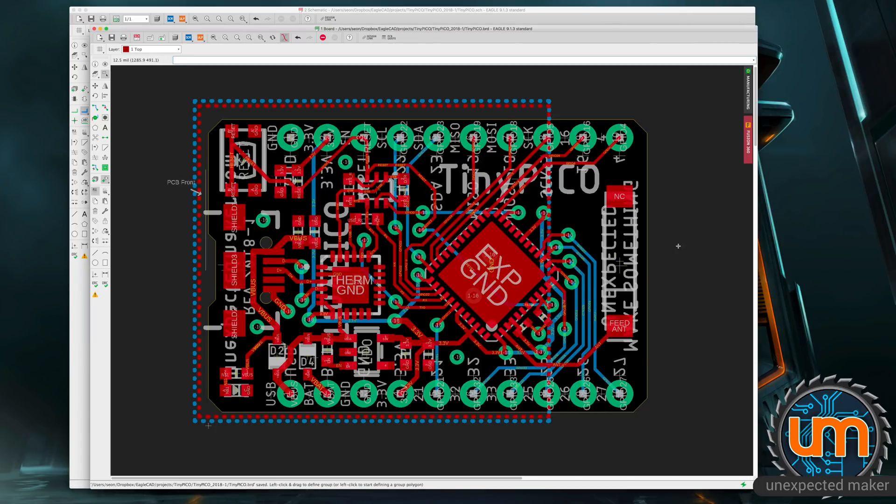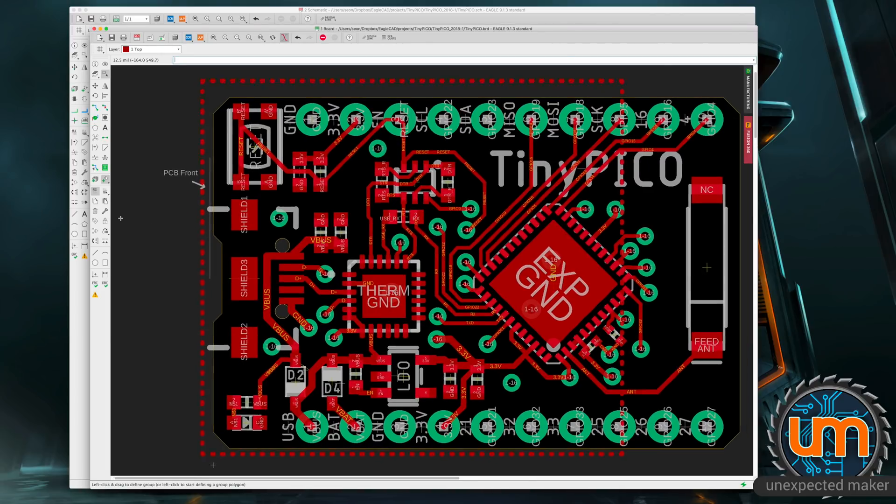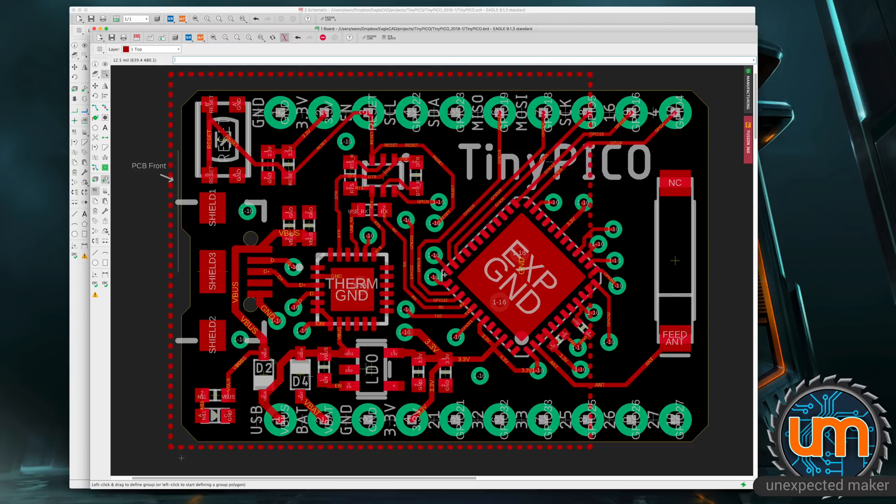Here's the board. I'll just get rid of the bottom for the moment and show the top so it's a bit clearer. Here's the Pico D4 — I've got it on a 45-degree angle because it's just easier to access a lot of the parts I needed. I've got my CP2104 sitting here, my voltage regulator, and a couple of diodes to protect power coming through. The VBAT is designed to allow you to connect a battery externally to this board, but the diodes will prevent you from accidentally putting charge back into them.